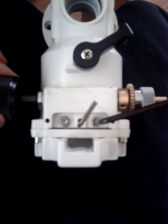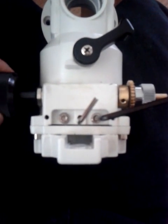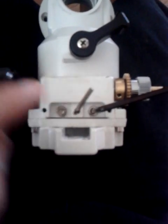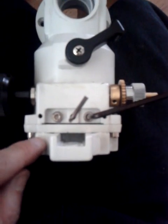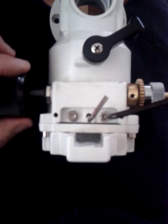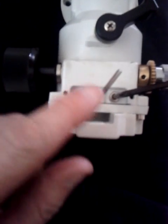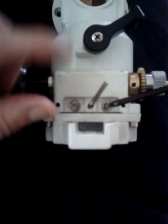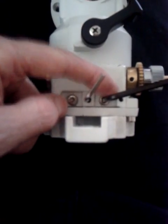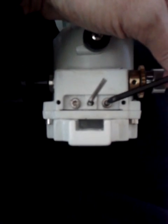You do that by taking off the motor drive if you've got one on there. You'll see these two bolts here with a little grub screw in the middle. If it's slack and there's play in it, you want to take that all out — so you move this grub screw by turning it anti-clockwise about a quarter of a turn, and then with these two bolts here and here and your adjusting hexagon bolt, you just loosen that by turning it anti-clockwise.